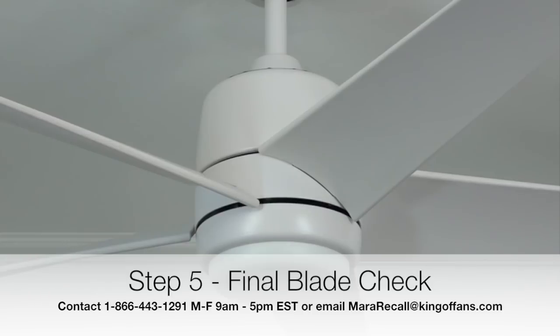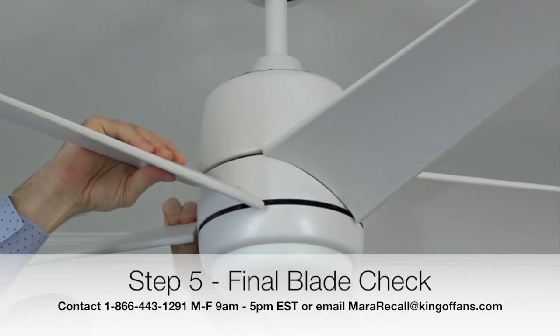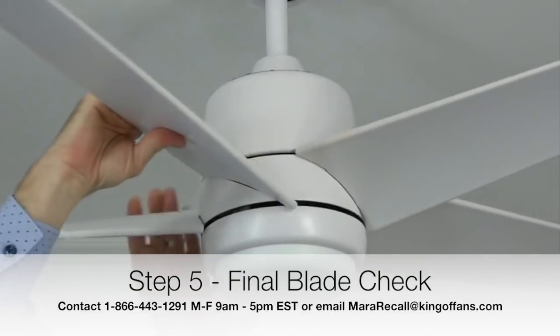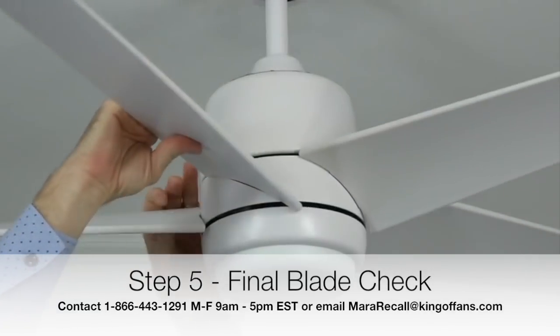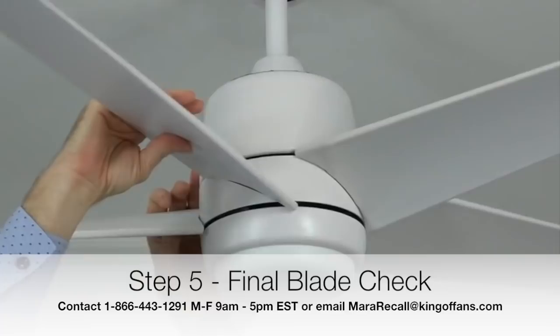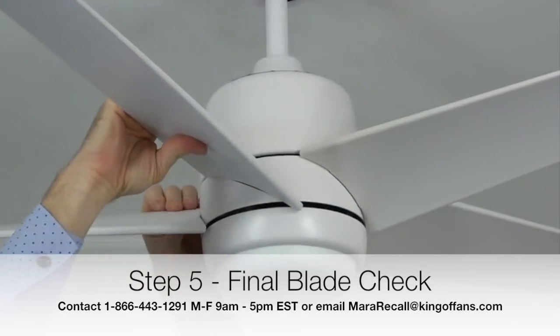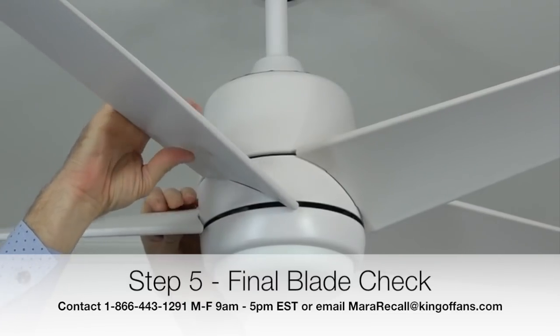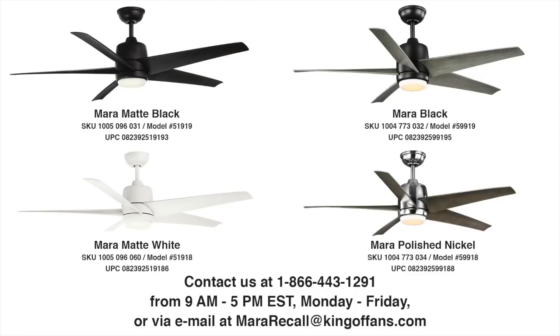Reconfirm that each blade is properly installed by gently pulling the blade away from the fan body. If a blade comes out, push the blade back in until the blade clip fully engages. You may hear an audible clip when the clip engages. Once again, grasp each blade and attempt to pull and move it back and forth within the fan body. There should be no movement of the blades when installed properly. If there is any movement between the blades in the fan body, please discontinue use of the fan and contact us. This concludes the inspection of your 54-inch Mara ceiling fan.